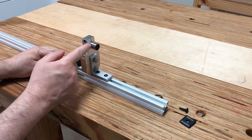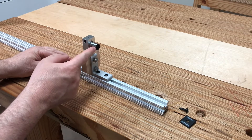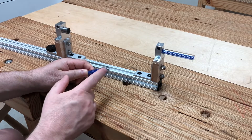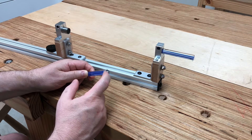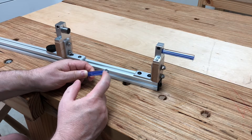You can also position where this drill bushing is just by loosening up this hex nut — you can leave it as is or move it down. I'll also have this 12 millimeter rod with a pointer. This will allow you to use the drilling guide to drill spindle mortises in arms and bows where the mortises in the seats are just marked and will not be bored until after the arm and bow spindle mortises are done.